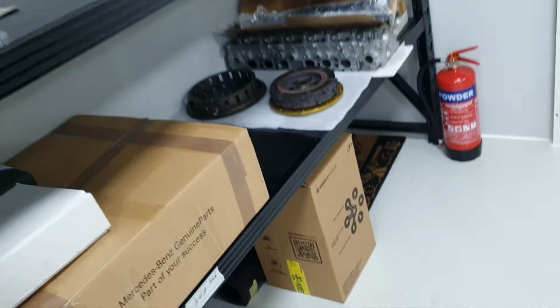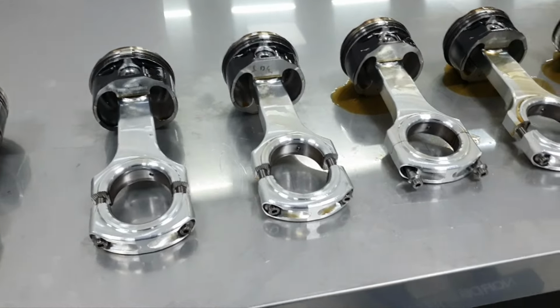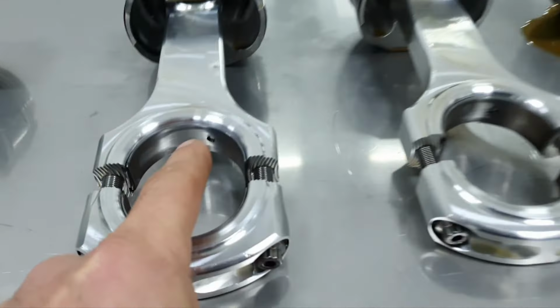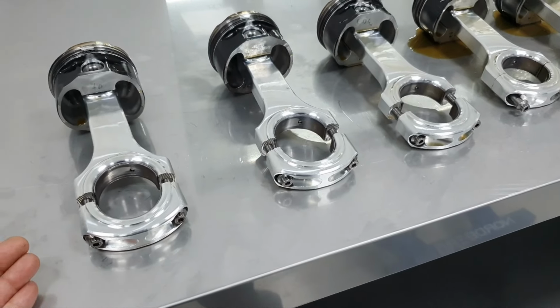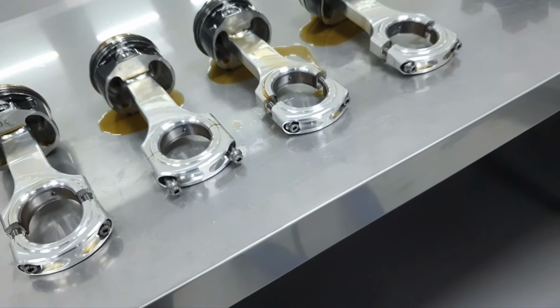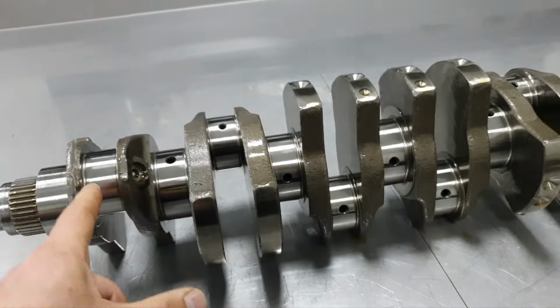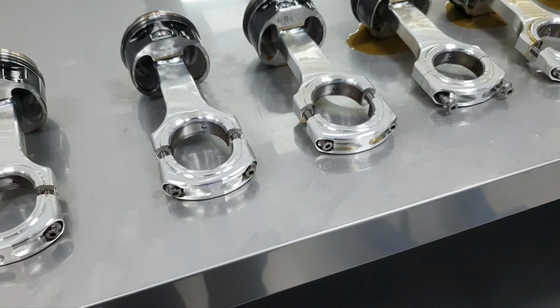You have a stock crank, and you have this clutch, the flywheel, the ATI damper pulley, and light aluminium connecting rods. What I believe is that for the upper one, even if I put in new bearings, after he makes 5-6 runs, I have to ask, but I think he didn't make more than 6 runs. Every 6 runs, you're going to end up like this, the upper connecting bearings. I can make the clearance more tight. I don't want to touch the journals for the connecting rods. I was thinking of making the clearance tighter, but the aluminum connecting rods are a little bit more flexible, yeah.